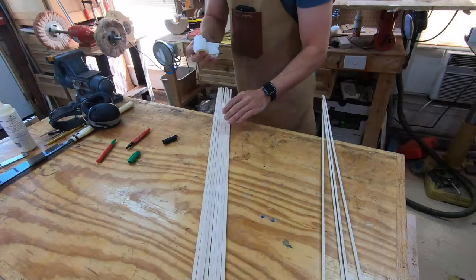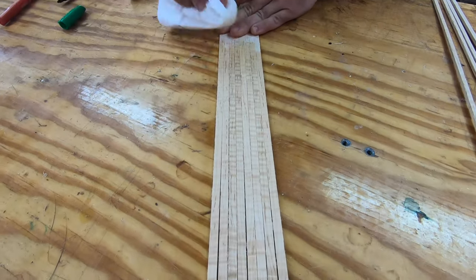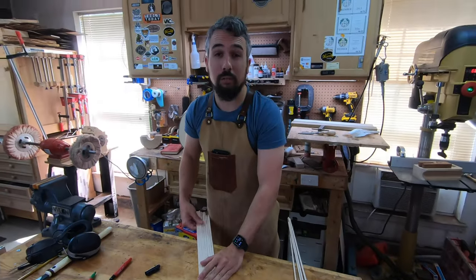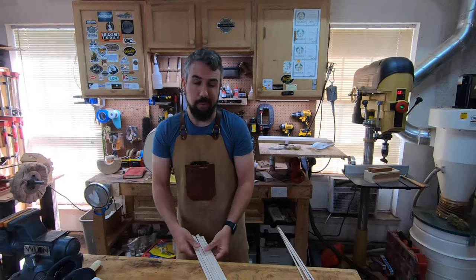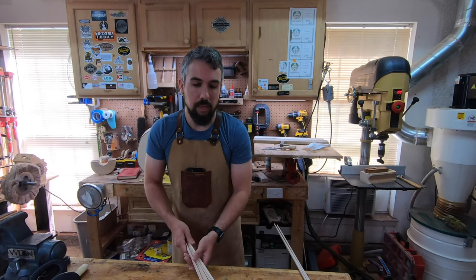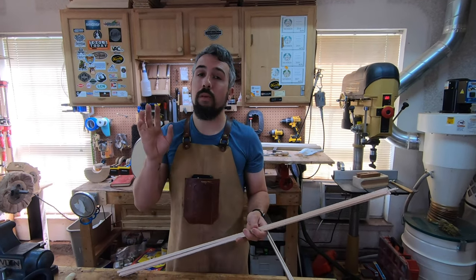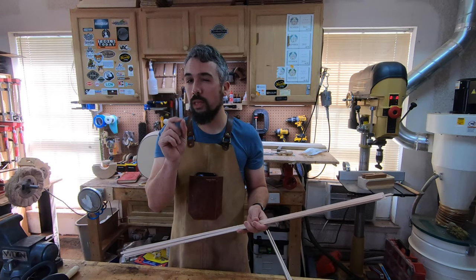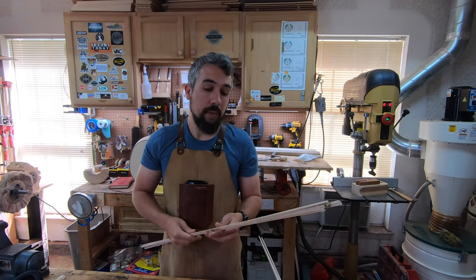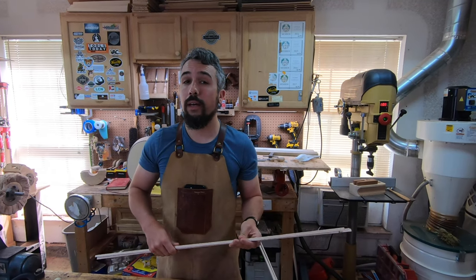Here we go — ready for the reveal. Yeah, I mean, it was a quick little video but I think it showed you guys a useful skill. Maybe I'm just dumb — I didn't think about doing this until after I owned my drum sander for a couple of years. Hope you guys learned something. If you make your own binding and you do it differently, let me know. All of the skills I showed you here can be used on the table saw as well — just be mindful it's a little more sketchy, you need a zero clearance insert, and it's going to waste more material because of the kerf of the blade. Make sure you like, subscribe, hit the notification bell, and we'll see you in the next video. Thanks so much.